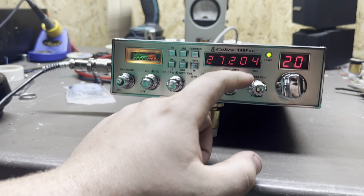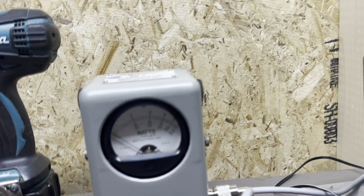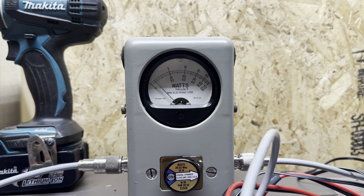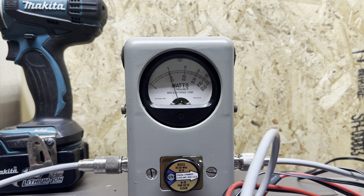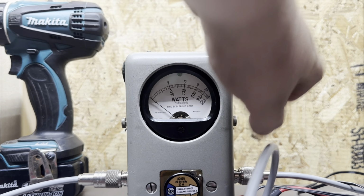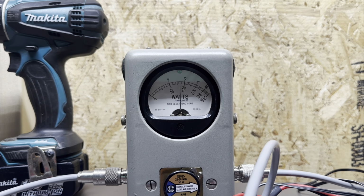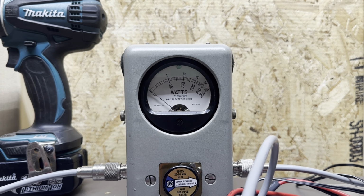So anyway, let's get to the power output. Oh, we bumped the knob. There we go. So, power output. This is a 50 watt slug. We're going to read average power middle scale. I set it up for you for a 2-watt dead key. Oh, audio. 10 average, 10 bar. Let's go to peak. This is on AM. Audio, 30 peak. So we're actually gonna go to lower sideband real quick. This is still on peak.